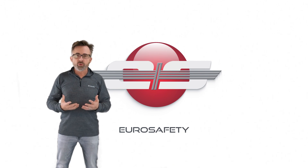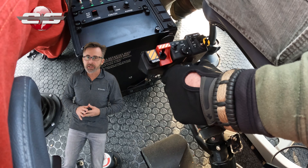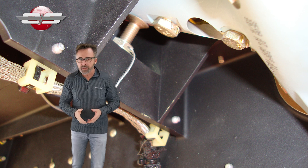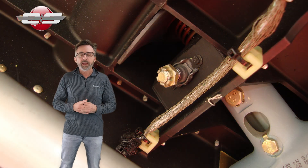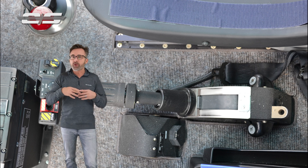The way that we control the amount of auto-rotational RPM when we have full down collective is the down stop bolt on the collective. There's a bolt that limits how far down the collective can go. If you need more RPM, that bolt is just unscrewed a little bit, and the collective will sit lower, and you will have a higher rotor RPM.